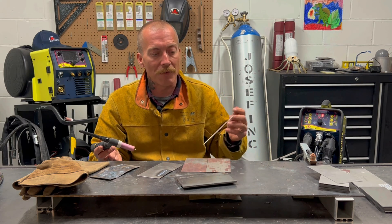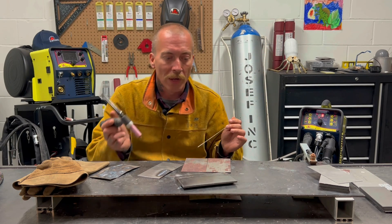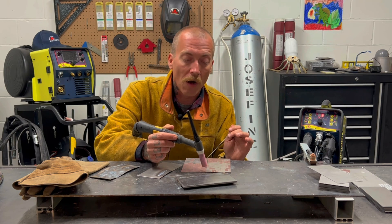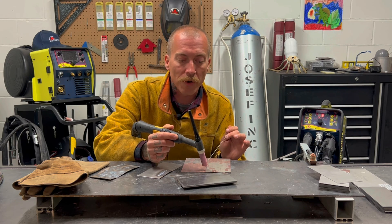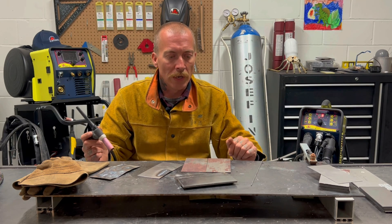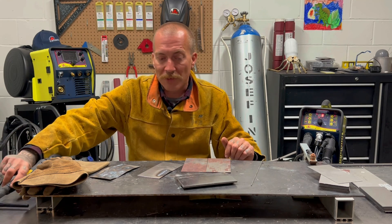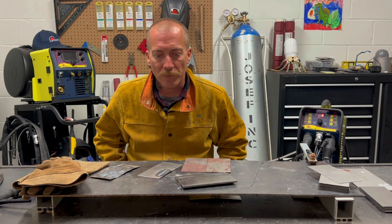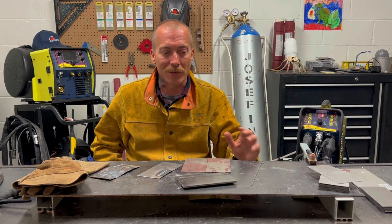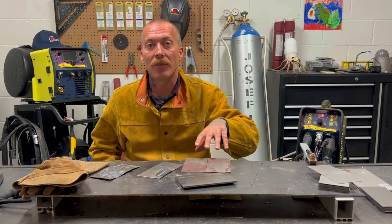You get to decide by setting the frequency how long a break the metal gets in-between. When you're on the high end — say going from 50 to 5 amps — when I'm at the 50 for that second, that's when I do my dab. Then I move forward on the 5, dab on the 50, forward on the 5, back and forth. It takes a little getting used to, and I'm not the best pulse welder in the world, but I've seen guys that do it all day long, doing art with it. When you get really good at it, you can lay beautiful, very consistent beads on really thin gauge material without bending or discoloring it.